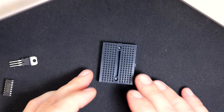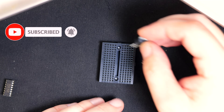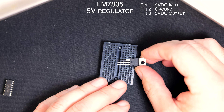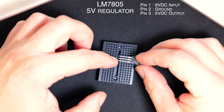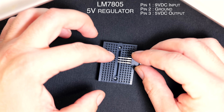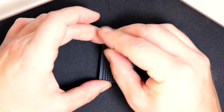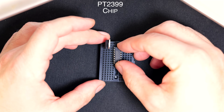Right, let's start putting this together. This is going to be a fairly improvised build. First I'm going to put in this regulator — it'll go along here. These regulators have got three pins: this is your input pin, this pin has to go to ground, and that's your output. So if you've got 9 volts coming in there, that's ground and that'll be 5 volts coming out. I'm going to put it this way — you just push it in. It's very plug and play style.